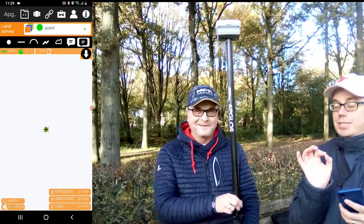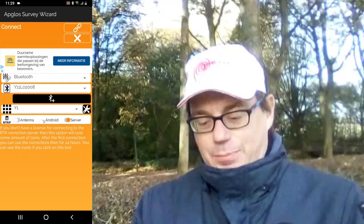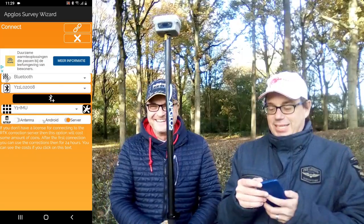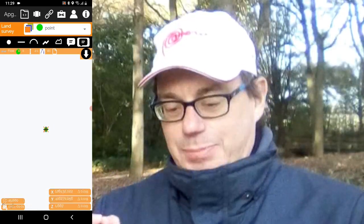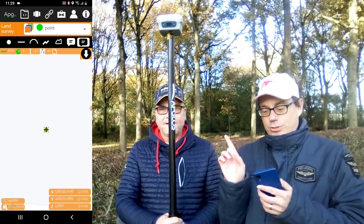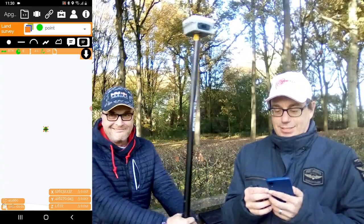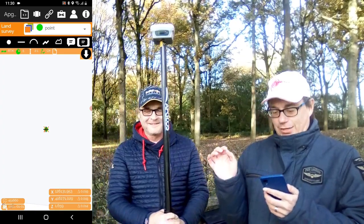For tilt measurement, we go to the connect menu and click connect again. We put the type of receiver to Y1 plus IMU, then click connect again. It says wait for RTK — it has RTK, still has to wait. Then it says hold still. Now it says to shake — bigger shakes please. Now it says OK.